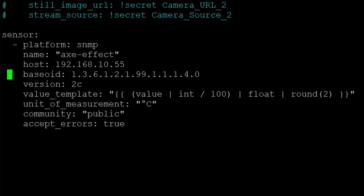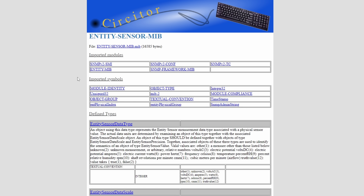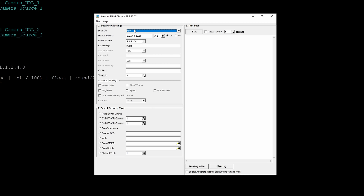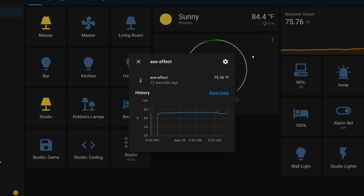The base OID was a little tricky to figure out, partly because I'm a complete beginner with SNMP and it's a little complicated, and also because there's not a lot of documentation for this thing yet. In Jeff's video he mentioned they're using a common MIB — basically a way to interpret the SNMP output and know what is what. I looked up the MIB he showed, which is the entity sensor MIB, and went down to sensor value, which has a specific OID — that's the OID I put in the config. I also used an SNMP tester to walk the base OID for the entity sensor, giving it the IP address and port, and it came back with a result of 2433, which is the integer representing 24.33 degrees Celsius. So that's how I got it set up and working in Home Assistant.